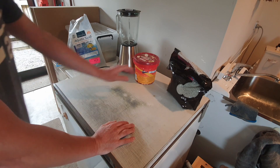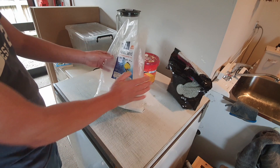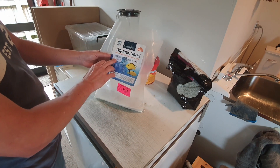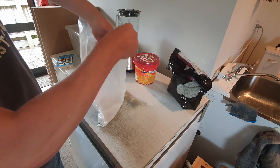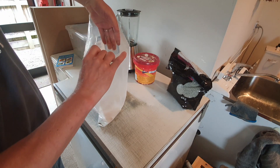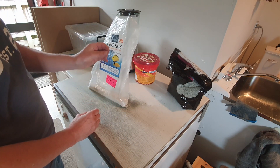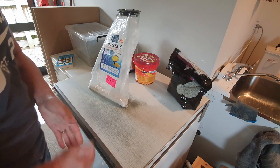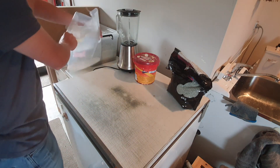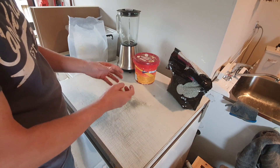They call it green sand. What I've used for that is some silica sand — just white sand. It's a really fine type of sand, and I sieved that sand as well, because obviously the finer the sand the better your definition will be on your castings.